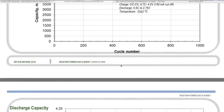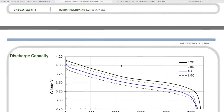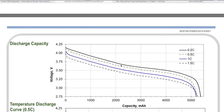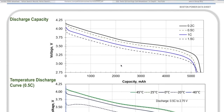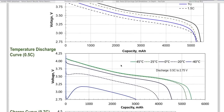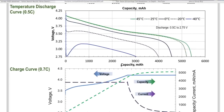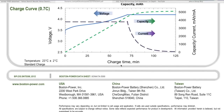If you do that full depth of discharge, you lose about 600 milliamp hours over about 600 cycles. That's the worst-case scenario for these batteries. But if you're using this for storage or an e-bike, you could just not charge them all the way up — charge to 80% or 90% — and you'll be in the thousands of cycles, like the spec says: greater than a thousand cycle life to 80% capacity.